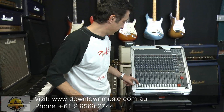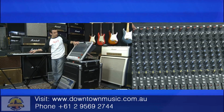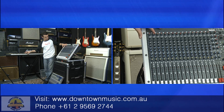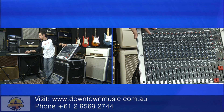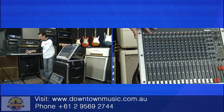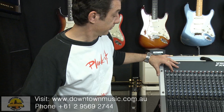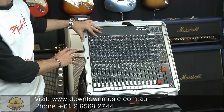Let's bring that down. Now let's once again watch the red light. While I'm doing that, I'm actually turning up the gain control. There it is. So that tells me that if the keyboard is set on about 2 o'clock position on its volume, I need about 3 o'clock on the mixer to set up the two volumes — the output and the input of the mixer. The output of the keyboard is now matched up to the input of the mixer.